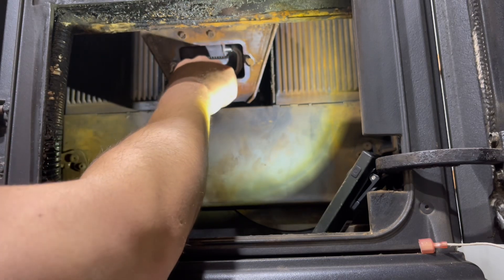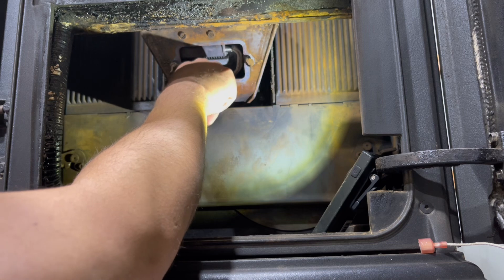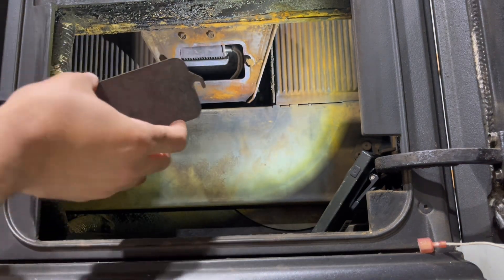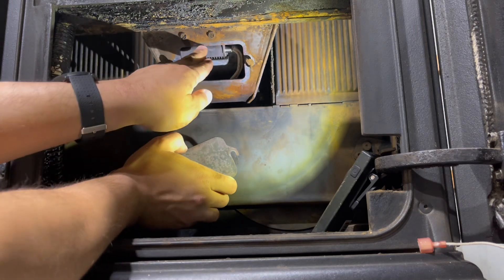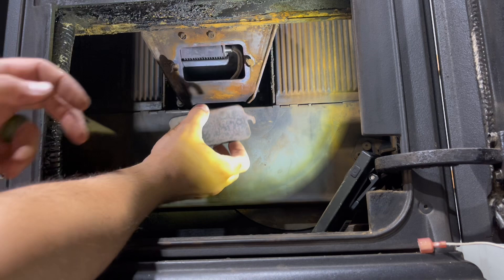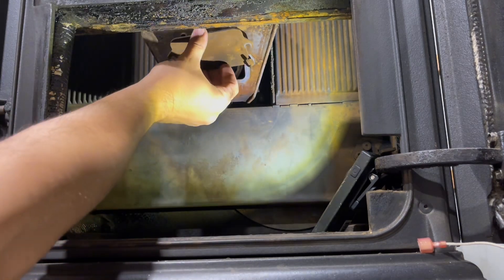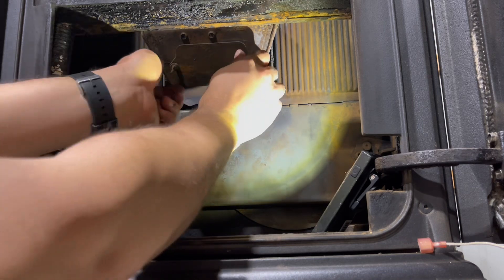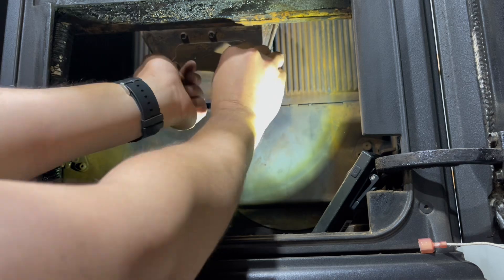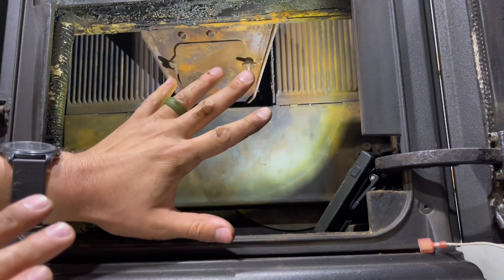Can you pull any more on the wire harness right there? Is that pretty snug? I'm not going to pull any more. Perfect — good communication. The bracket's on with the cradle, and we've got our wiring set, connections are still there. We're then going to replace this plate and tighten the wing nuts. Right then and there, your igniter's in — the front part is done.